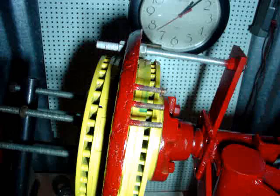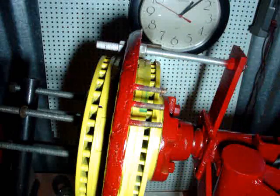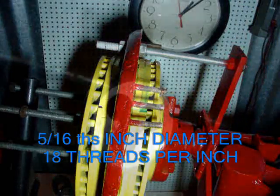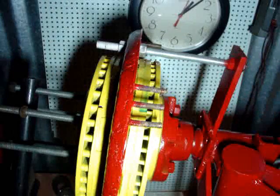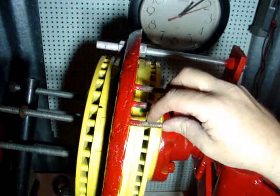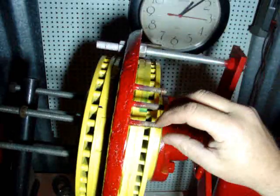I'm Scott Brown with Green Wind and Other Home Energy. I've got a tap and die set here — I pulled out a 5/16 NC 18-thread tap. Basically that's what these toilet bolts are; they make them out of brass to keep corrosion down on the back of the toilet for keeping the lid on.